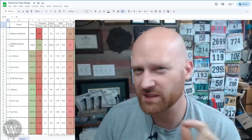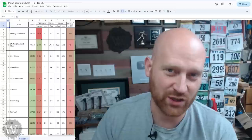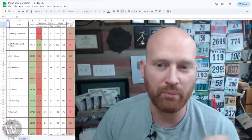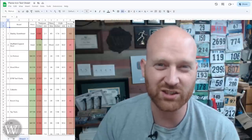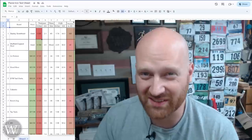The one problem I had with this particular test is the edge retention. The Xinwu irons are laminated, and that means that there is less actual hard steel right up at the tip. And so they generally will sharpen faster. But the test done here only tests the very tip. So the sharpenability will actually be a little bit better for them, though I've left the data raw so you can actually see how sharpenable the actual steel at the tip is.